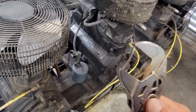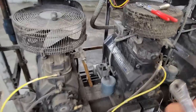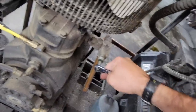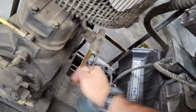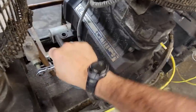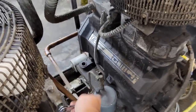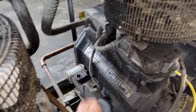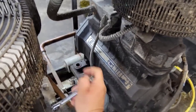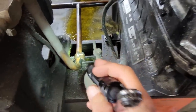We're gonna go ahead and go through here. You guys know how to close a valve, so I'm not gonna record that. So we're gonna go through. Discharge closed, which that'll isolate us. So for the most part, we have four valves to close. So we'll get these all cranked in, and then we can go ahead and start our repair. Everything's in a positive pressure, so we don't have to really pull no vacuums or anything like that, but we can if we want. Repair, like I said, is gonna be right there.